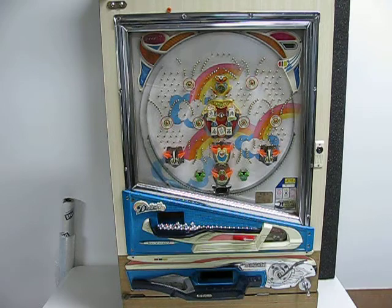All the mechanisms on the machine were completely rusted up, so that was one of the main reasons it wasn't working. And there was tons of debris within all the trails in the back of the machine. The wire harness was completely shot, so I had to create a new one for the lights.